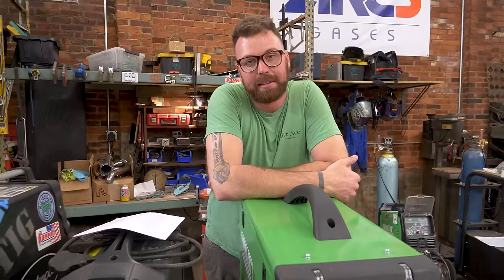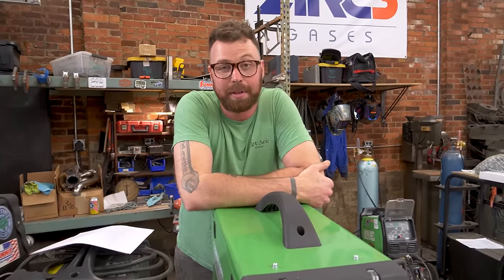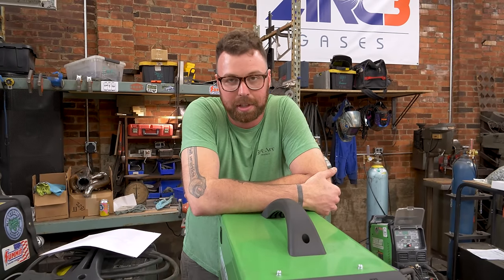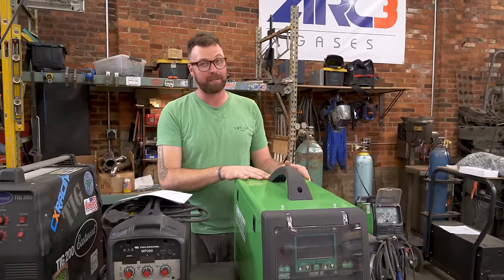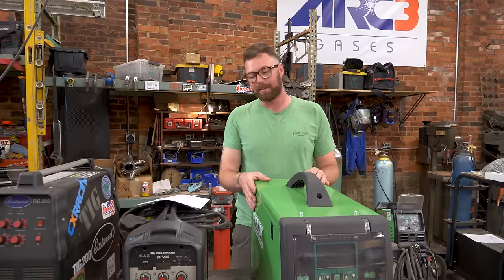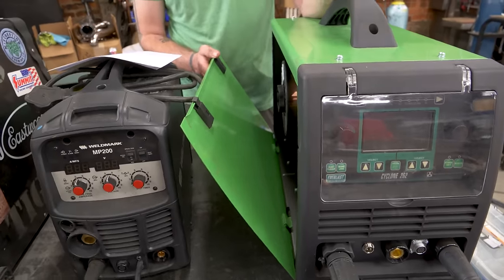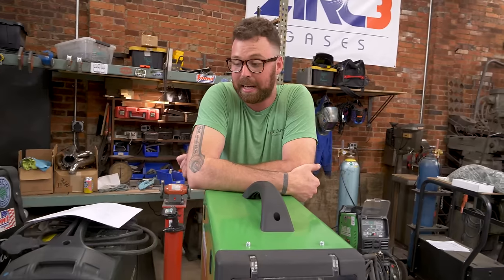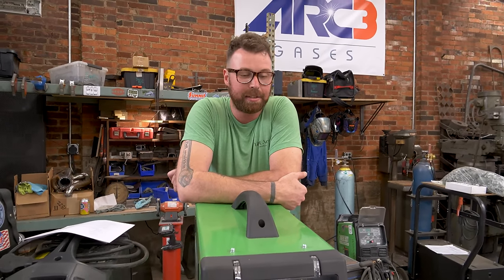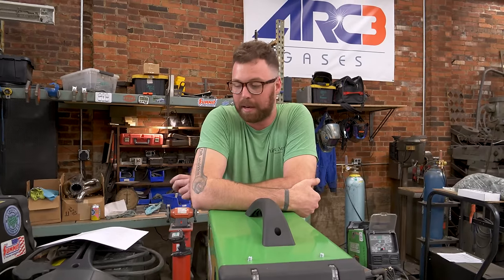The point of the power set is that you're not supposed to be an expert for it to work. I know what a good MIG weld is supposed to feel like — I've been doing it for 16 years — and the power set on this machine is just not there yet. This welder requires higher knowledge about MIG welding to set up right, because you cannot rely on the power set. It also does not come with a chart on voltage and wire feed settings. If you're new to MIG welding, you are going to have to find that information elsewhere — even I had to go online and look up ideal settings.